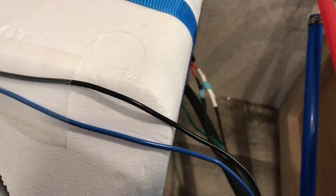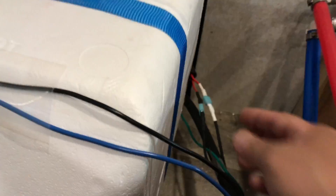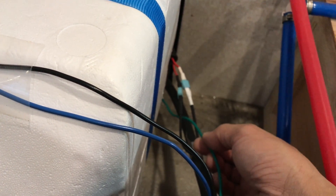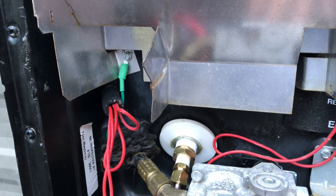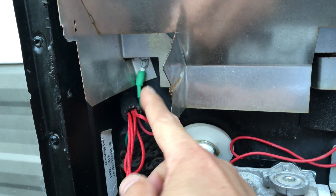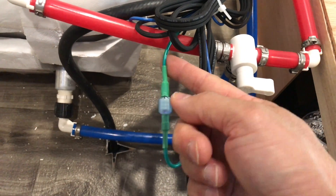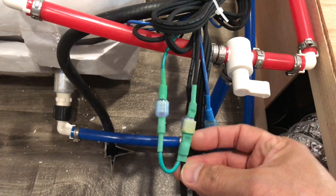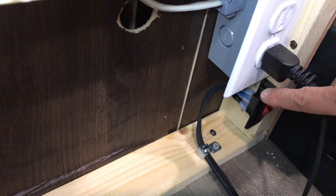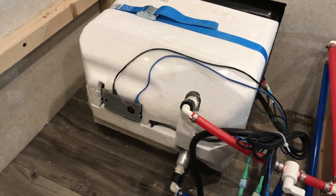This white one right here is actually one of the wires of the plug — black with a white connector. This is ground — the green one is ground, connected to the chassis outside. Let me show you a shot of that — it's a ground from the outside. Just drill another hole and screw it in right there using an existing screw. I just loosened it up and slid the ground in. Again, one of them goes out to the chassis, and this one right here is from the plug itself. And then this one right here just circles back and connects to the top of the switch with the gold post.